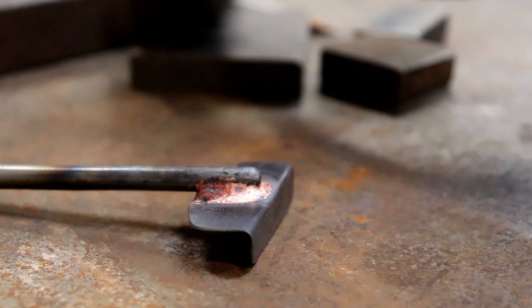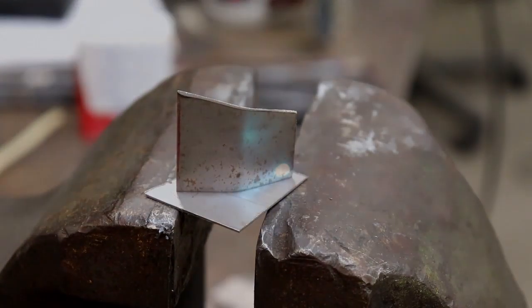If you add an abundance of copper rod and then just run the torch over it one time, you get a nice fillet just like that. And if you were wondering how strong the joint is, hold on just a short while and I'll show you a few test pieces. I'll braze them up with the copper and then do a destruction test. What I'm going to do first is just put a fairly good sized drop right in the middle, and you can see that I can work it all the way from one side to the other, just like you would with silver solder.